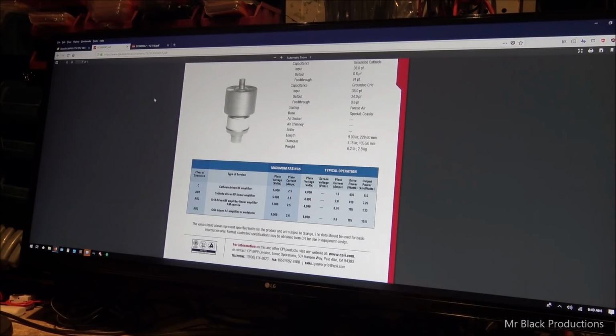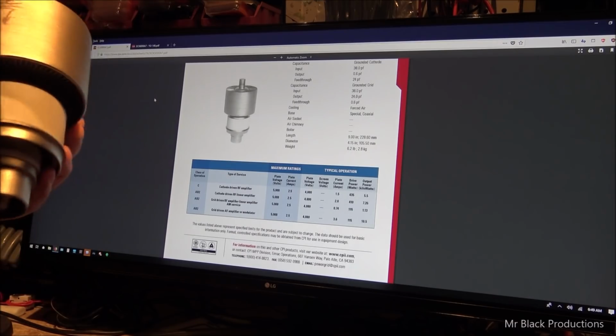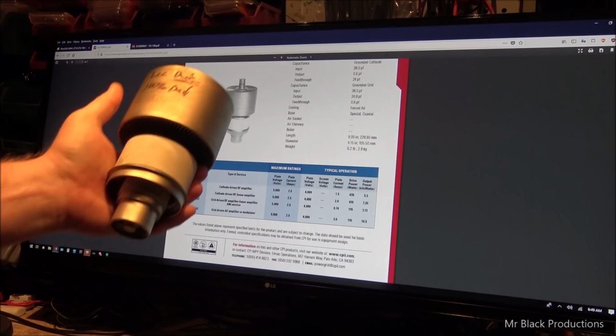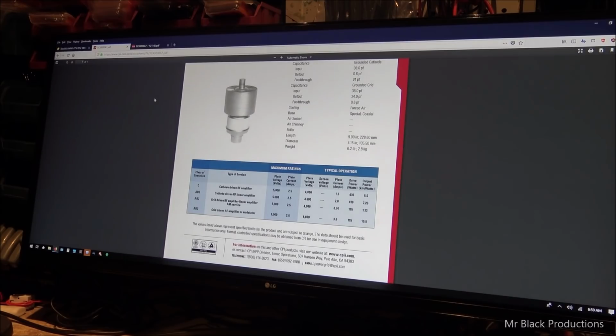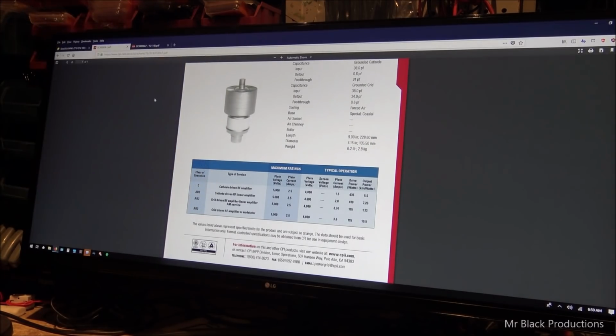Now we're going to go get the tubes. So I have a couple 3000s sitting around here. As everybody knows from some of the videos I shot in the past, this is a 3CX3000A7. This thing's 100% bad. The filament on it is pulling way too much current, and as soon as you apply anything over about 1,000 volts to it, this tube shorts out. So you got to create the amp to support this all the way around.